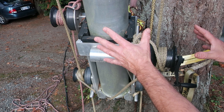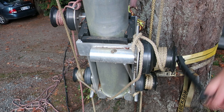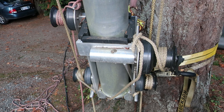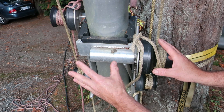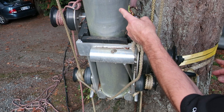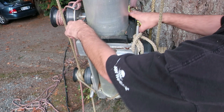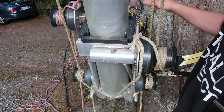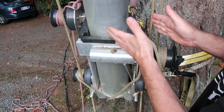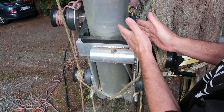The lifting and slewing is composed of sailboat winches — two speeds, easy control. They pop out of receivers so you can fit it into the back of your truck. There's a square tube inside; the bottom ones are bolted in just to keep them tucked in a little tighter. The whole assembly is tied in down below to the pivot point. It's very critical not to put any side load into the actual mast — it is a pure compression post, so there's no load on them.